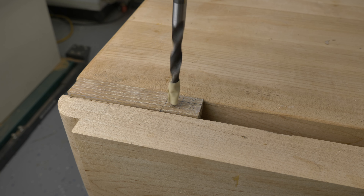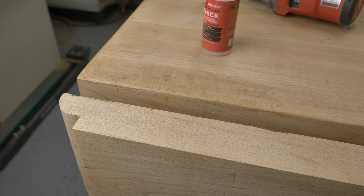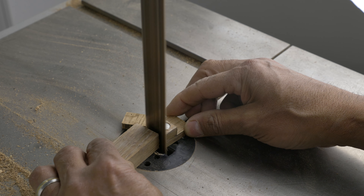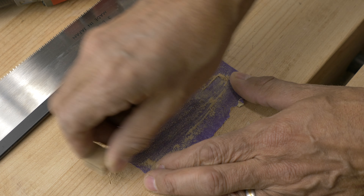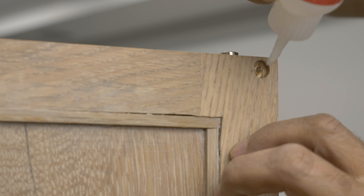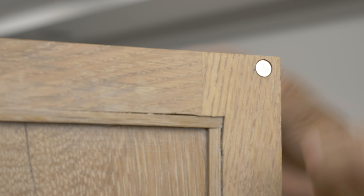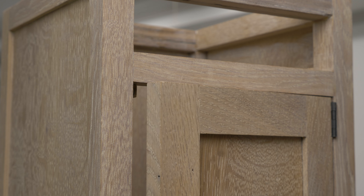I made a straw patch and used Starbond super glue to glue a rare earth magnet to the catch. I trimmed it on the bandsaw to the shape I needed, did a little light sanding, and attached it with more CA glue. I added the last rare earth magnet to complete the catch with more CA glue. And of course I had to test it — again, and again, and again. Who doesn't?